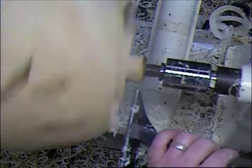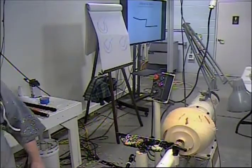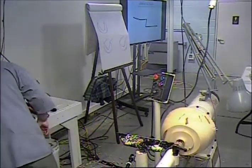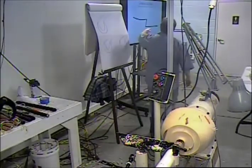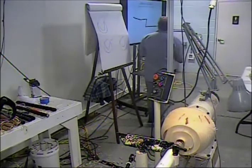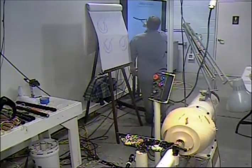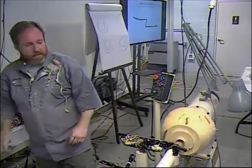And at the same time, we're plunging deeper towards the center to create that undercut shoulder. Just like that. What we've created now is what I've got up on the screen here. This dovetail shape, and hopefully you can see this shoulder is pointing in deeper. What that does is it leaves this point right here to seat completely flat against the face of your chuck